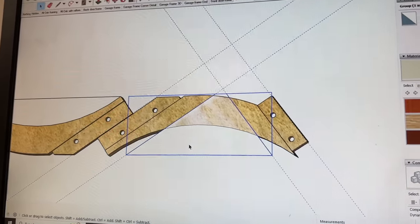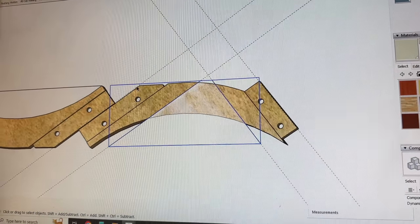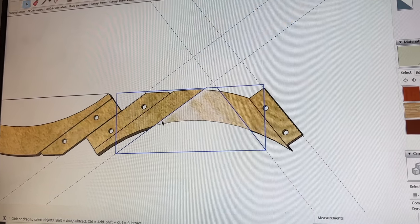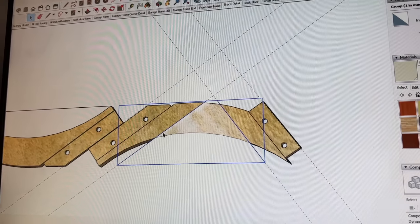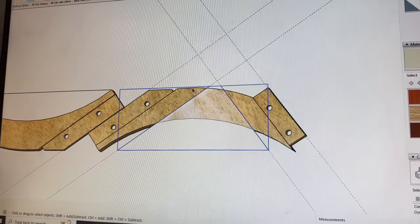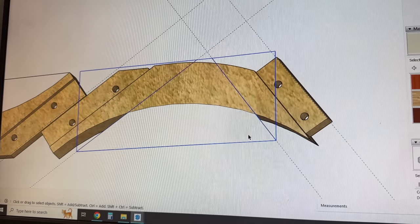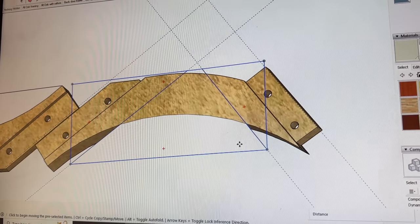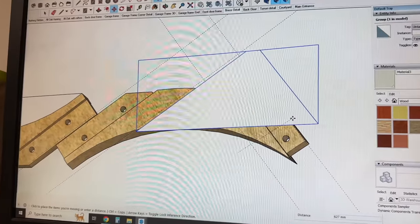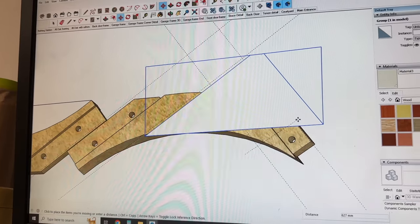Yeah. So make a little jig to cut these off. There's a piece of plywood set in from the ends of my braces here, 163 mil, which is the offset from my saw to the blade, and again 163 mil here with a 90 degree cut. So I can just take this piece of material here and take the dimensions of it, cut them out in real life, and then I've got a jig to cut the extremes of the braces off, so I'll do that now.